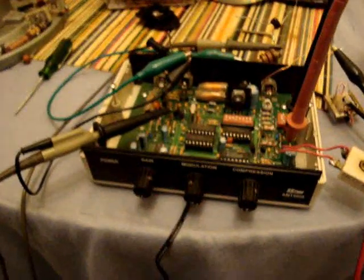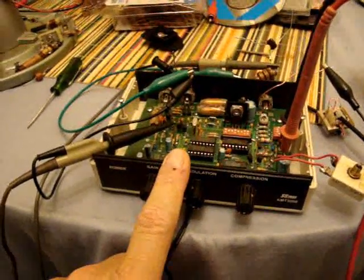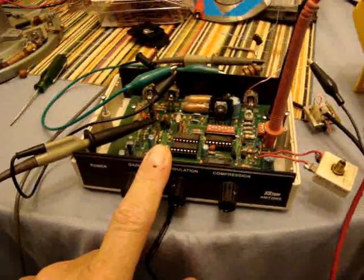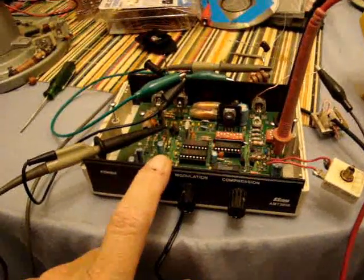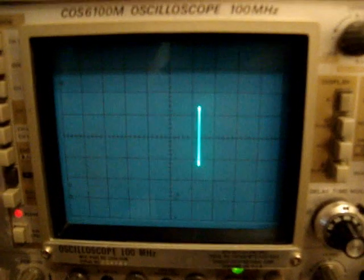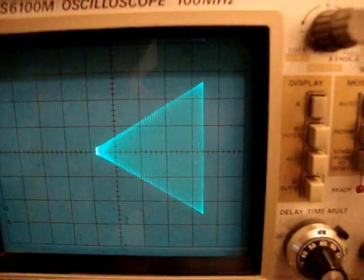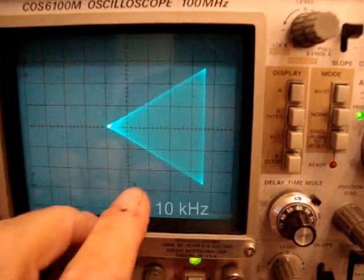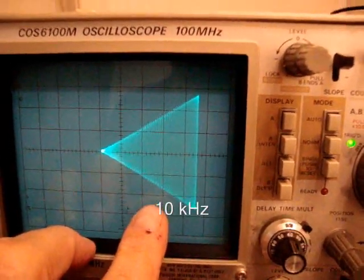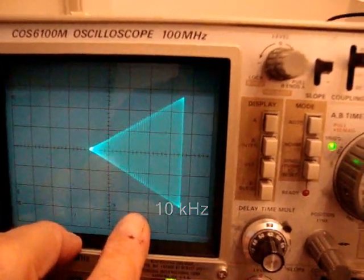The hardest thing with this transmitter is going to be for the high frequencies. In this case, we'll be using 10 kilohertz. We'll look at that 10 kilohertz on the trapezoid for linearity purposes, so we'll go to the scope. I'm going to turn up 10 kilohertz. See that? Looks real good. So at about 2 volts set up on the scale I used, 10 kilohertz looks real good.